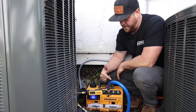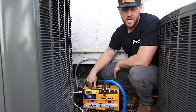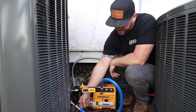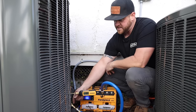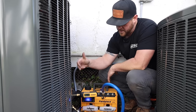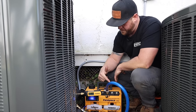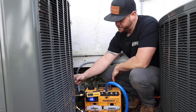The reason why I do a one-hose setup is because I want my micron gauge at the farthest point away from the pump, because that's going to give me a reliable reading immediately. If I put the micron gauge right on the line itself near the pump, it's going to be reading the suction of the pump. You'd have to close the valve and let it settle to get an accurate reading. So that's why I do a one-hose setup — on any residential equipment like this five-ton system. The micron gauge goes at the furthest point away, which is going to be the liquid line service valve.